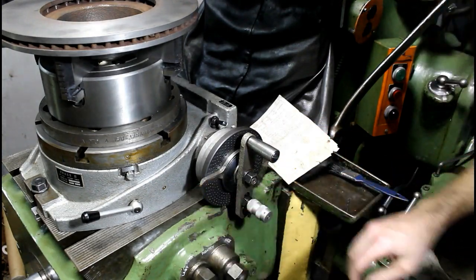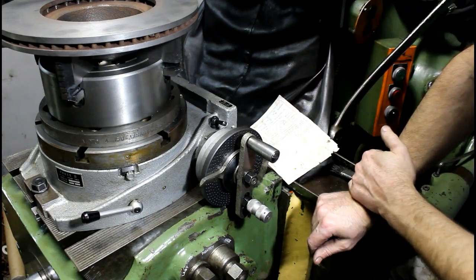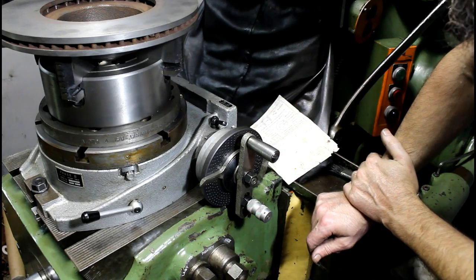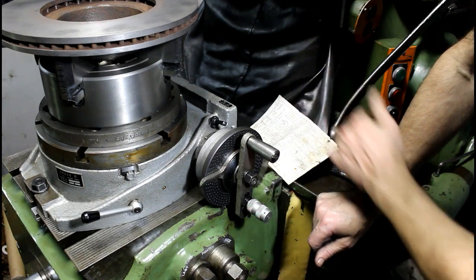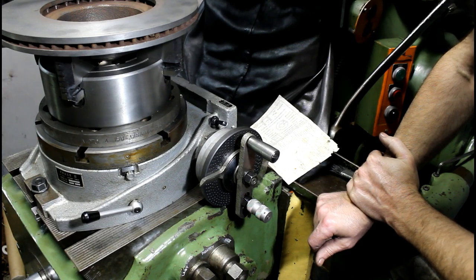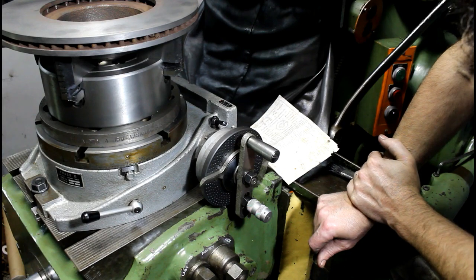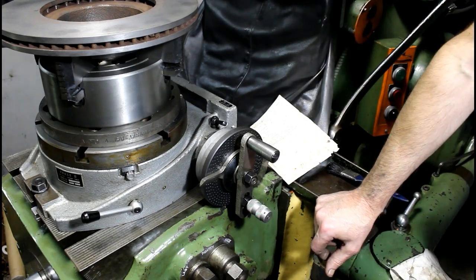That's it — it's real basic. You can get almost any number of divisions with a couple plates. This comes with a couple plates and they actually have different holes on each side, drilled from each side. It's a pretty nice little set and I've used them successfully for several years. A rotary table is definitely not a cheap purchase, but if you're running a standard manual shop it's a must if you have a milling machine and do any indexing at all. So that's how I index — let's start cutting.